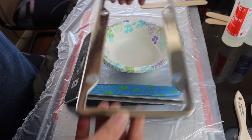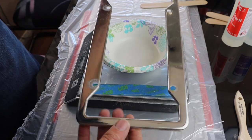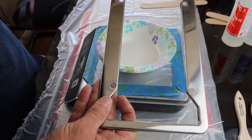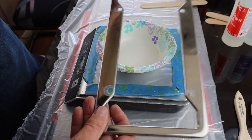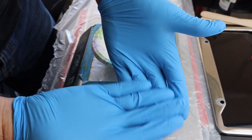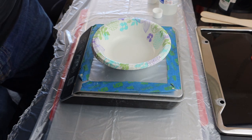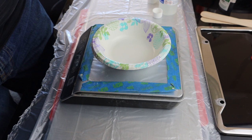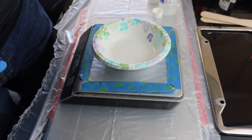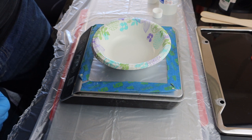Keep your license plate frame handy as a visual guide — hold it above the area you're wetting out to make sure you get enough overlap to cover the frame. Make sure you wear nitrile or latex gloves. Epoxy systems can be fairly toxic; some people have very adverse reactions and toxicity can build up in your skin over time. Also work in a fairly well-ventilated environment.